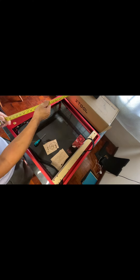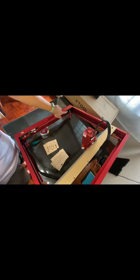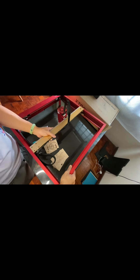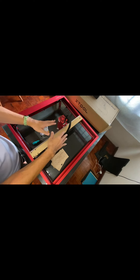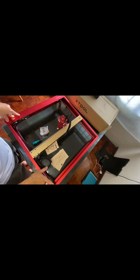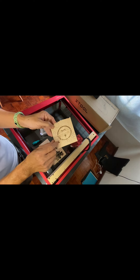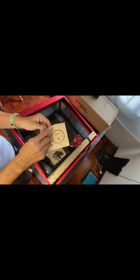The X-axis coupling down here actually solved the issue on the X-axis. But my problem persisted on the Y-axis. I found out that I had over-tightened the screws down here — this couple of screws. I managed to unscrew all of them and reinstall the whole unit back. After reinstalling, I measured all the sides again. When I did the squares and circles, I was very happy — I managed to get a true circle and proper squares. That is how I actually solved my unit's alignment issue.